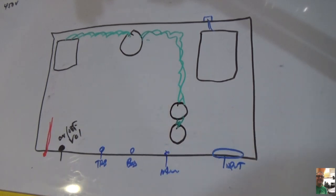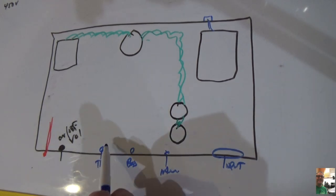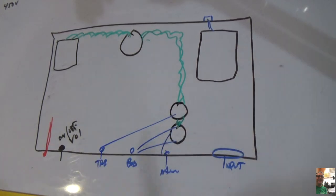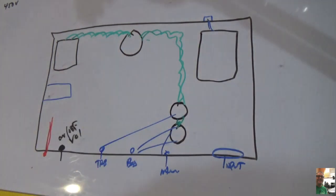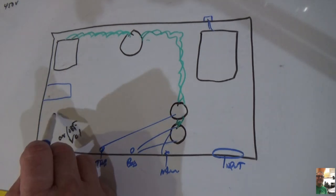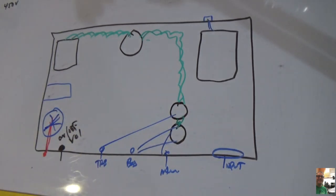intensity. And you'll notice everything is very close to these 12AX7 tubes because most of the wires for these are going to run to these tubes. So this is a very clean amp build. Okay? And I should have some space right here for my choke, which has to go somewhere in the power section. And you'll notice on the flip side of the cabinet, this circle is where my electrolytic cap is going to mount. So I'll have a hole there. So I'll have everything in close proximity.